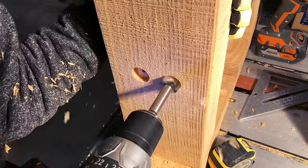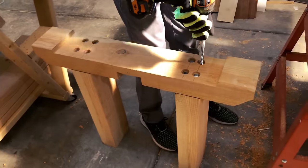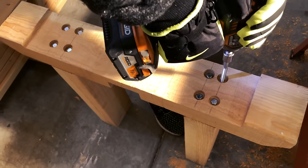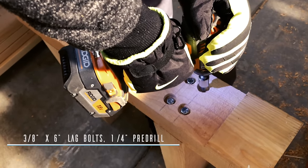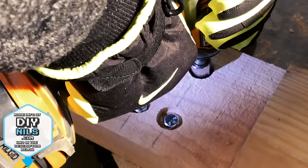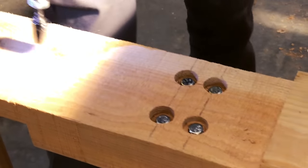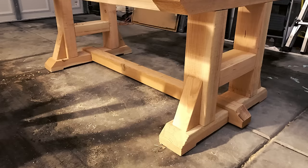I made sure not to just drive these six-inch lag bolts in because I didn't want to split the wood. I marked the location of each of them, then used a one-inch Forstner bit to drive about a half inch down so the head would sit completely concealed. Then I used a quarter-inch drill bit to pre-drill the length of each of the lag bolts so the threads did all the work and there was no chance of splitting. I had my son out in the garage helping. We used the impact driver to drive all these down. One thing I would have done differently is use washers on these — good-sized washers so you can drive the heads right down to the washer. Also, in order to run that 4x4 piece across both feet and have it sit flush, you'll want to use a band saw to remove about half the thickness of the wood so the two pieces sit inside one another.